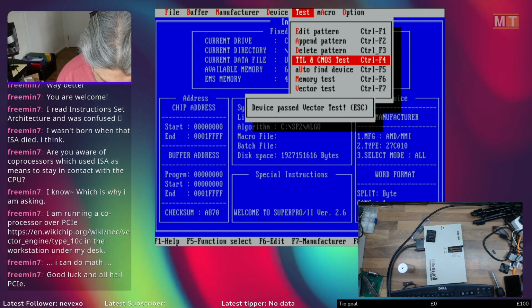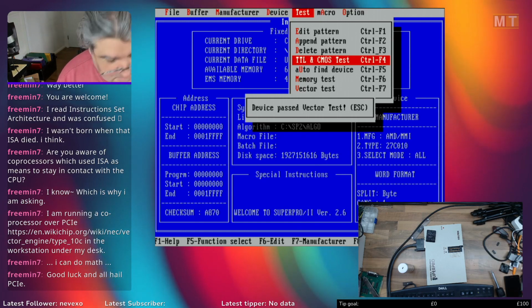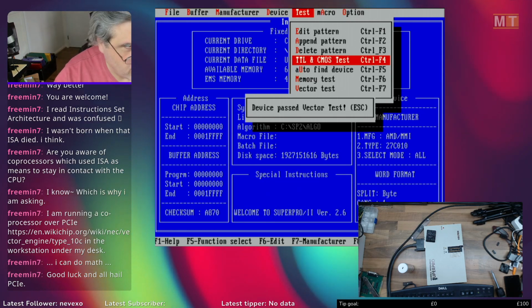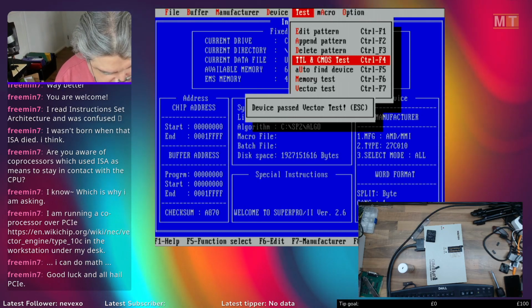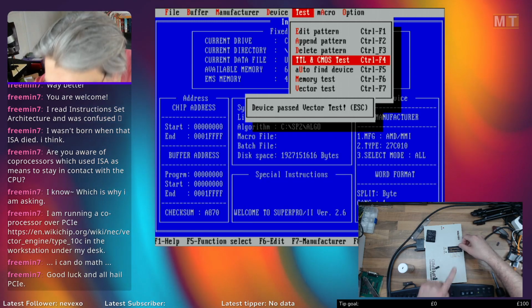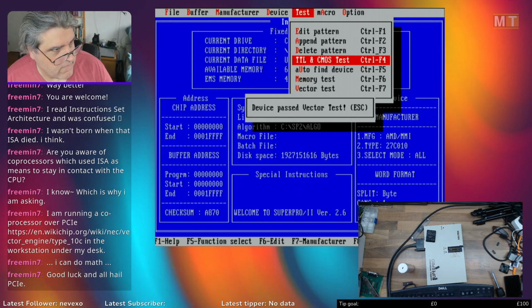And this one, I've soldered. Oh, it's got another pin missing. It's got numerous pins missing on this 74HC32. There's no way that's going to work. This one is really gnarly with solder. I can't even see what number it is. That's going to need cleaning up before I can test it. And finally, the 74S00 again. Device passed.